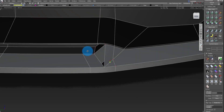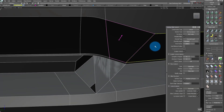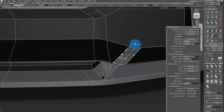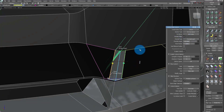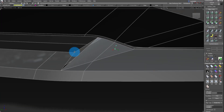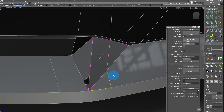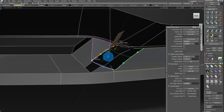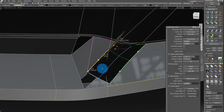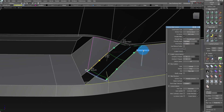Here I'm just going to quickly add some curves and surface this little corner as a square, because at the outer edge I know the fillets are just going to eat it up. Now I have another point where I start adding even more fillets. As we get to this next section, let's keep in mind that we're also being very loose with it — we don't care too much if we really reach curvature or even tangency, as long as it's relatively good. I'm just adding a little fillet that kind of goes through both of them, and they're all the same size.